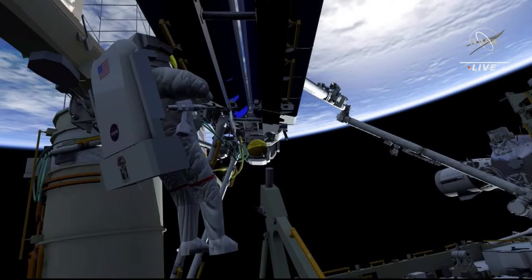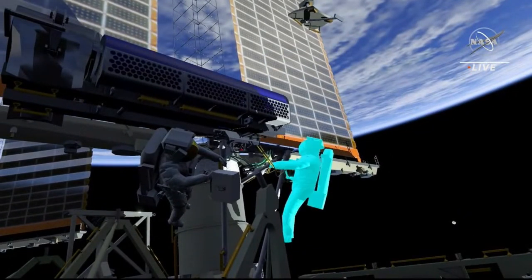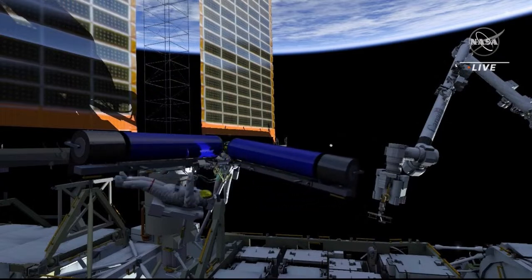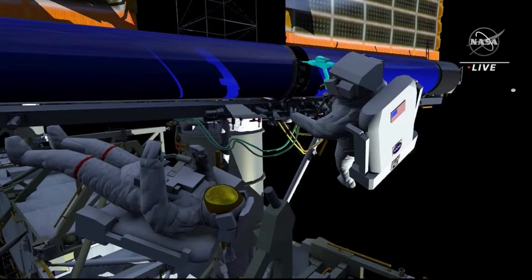The crew will release the scoops, and EV2 will move into position to release the final bolt holding Irosa in its folded position. Once released, EV1 will hold Irosa closed while EV2 egresses his foot restraint and gets into position. Both crew will then work together to unfold Irosa and secure the right side onto the mounting. Once secured, EV2 will drive two hinge bolts that hold Irosa in the unfolded position.